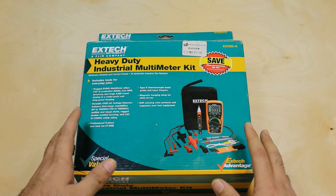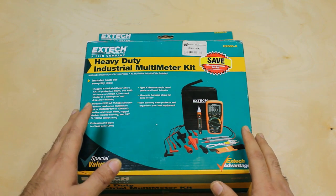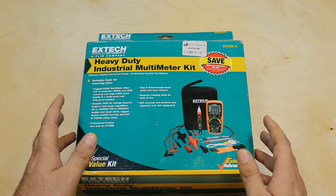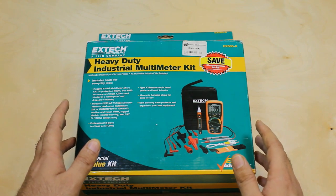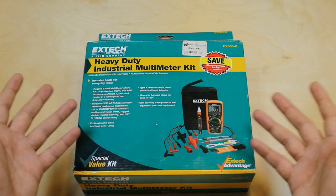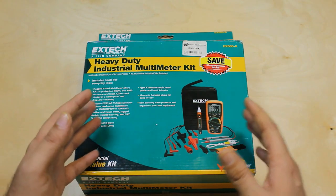The main reason I purchased this multimeter is that it has a versatile range to measure AC and DC current. It measures current ranges from 0.1 micro amperes to 10 amps, and it's a true RMS multimeter which can measure with better accuracy. Although there are a lot of multimeters that have this kind of feature, they are much more expensive.